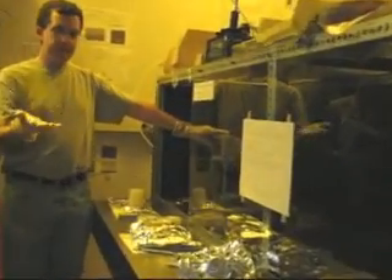A lot of interference lithography systems use two spatial filters and split the beam before they get to the spatial filters. In this one, the second spatial filter is basically a mirror image of the first, so we use this mirror to form essentially an image of the second one. Samples are mounted to a vacuum chuck here, the mirror is closed, and then you're ready to go.